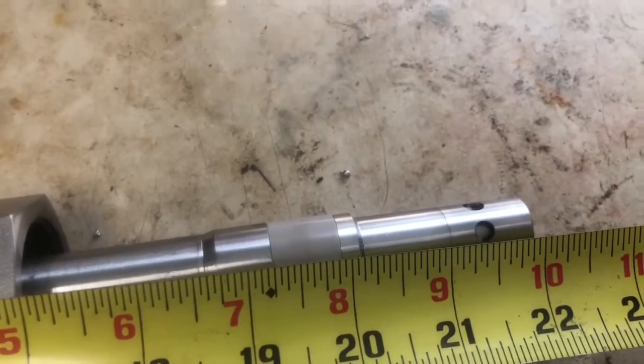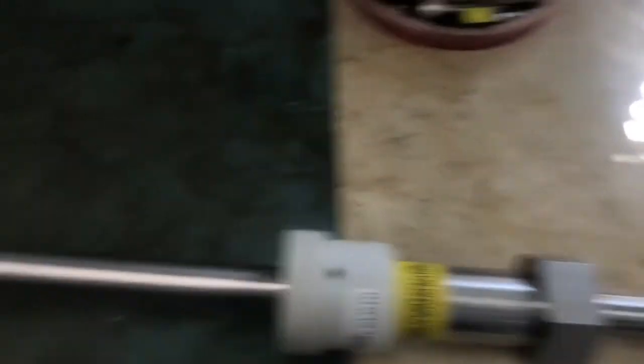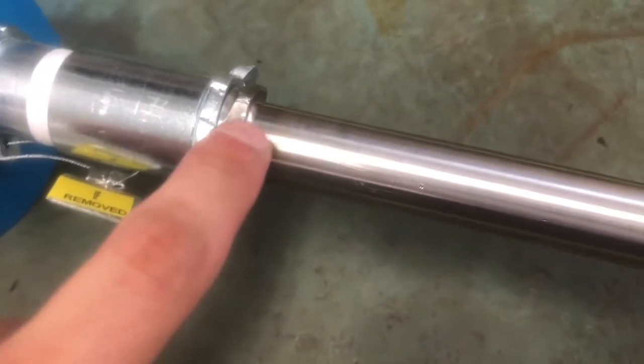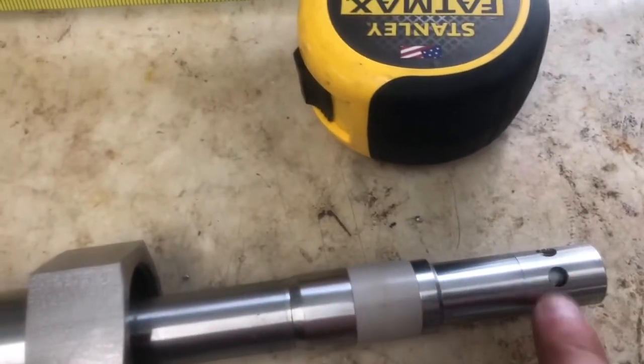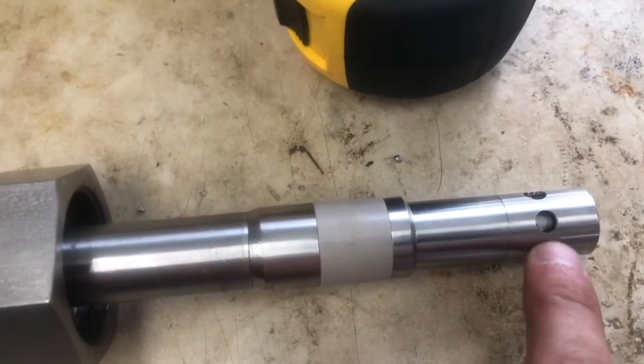On this sensor we measure 22 inches, so when we install the sensor we need this nut to be 22 inches from the inner wall of the pipeline so that these holes are flush with the inner wall of the pipeline.